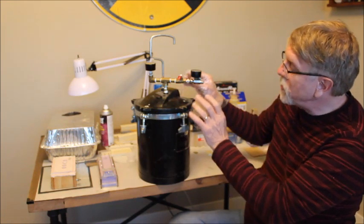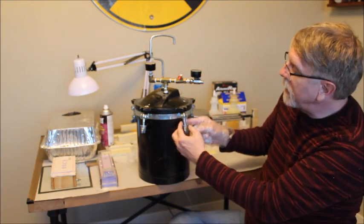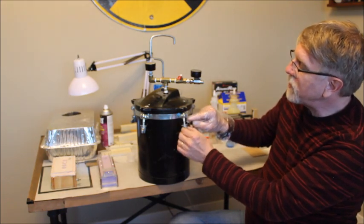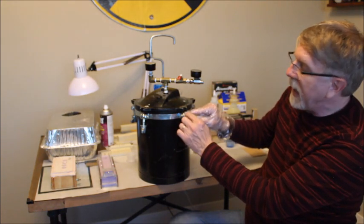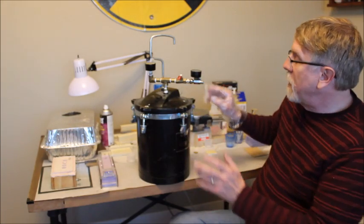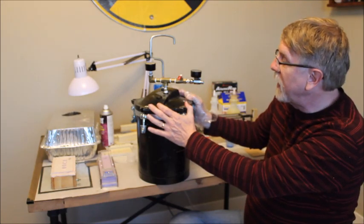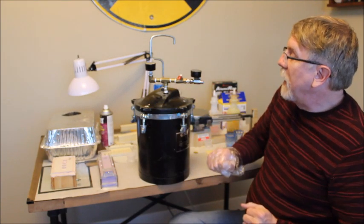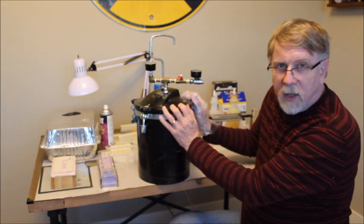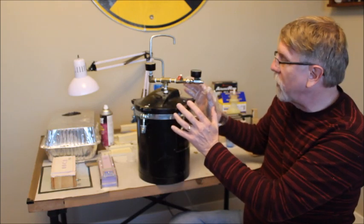You want to make sure that you are below that. You want to inspect the paint pot, these bolts, the hinges for the dogs, and the eye bolts of the dogs to make sure there are no cracks, because once you pressurize this to about 40-50 psi, it's basically a bomb. So you want to make sure that everything is tight and there are no cracks in it where nothing's going to break.